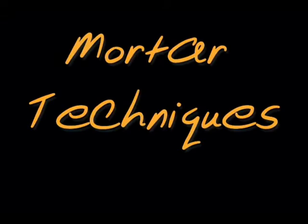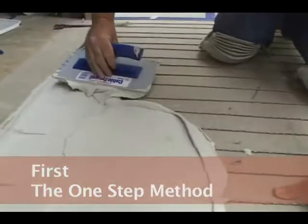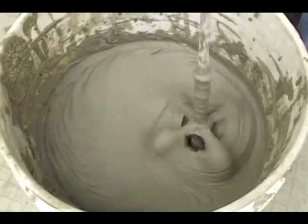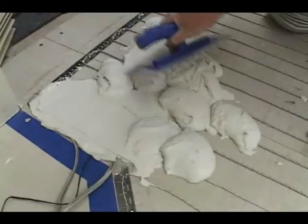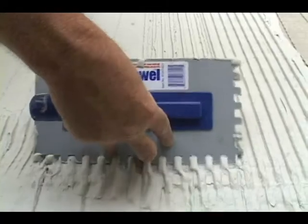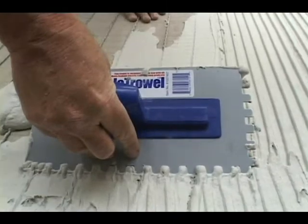Here are some common ways to cover warm wire in a masonry floor. Use a good quality latex-modified thinset mortar. Apply thinset and then use the flat edge of the trowel to work it on the floor and between the wires. Work the thinset with the wires to keep the spacing at two and a half inches. Then apply more thinset, reverse the trowel, and comb it in straight lines the same way the wires run.